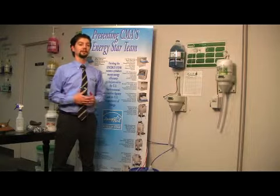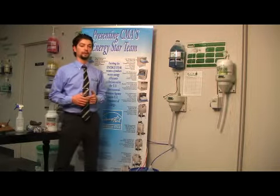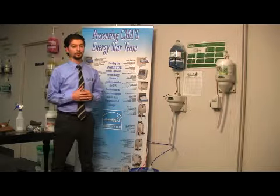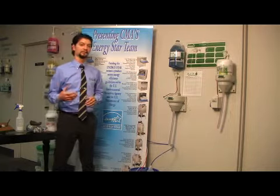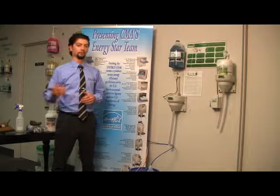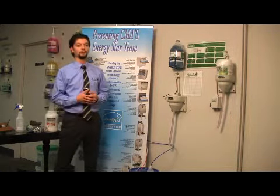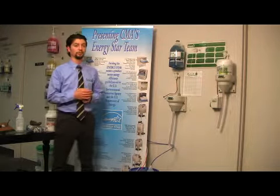Next, I'm going to discuss if you're getting too much detergent. This is going to apply to either the liquid or the powder detergent. The first thing you're going to want to check if you're getting too much detergent on your conveyor or your high temp door machine is if the machine has any leaks. If the machine is leaking, it's going to be introducing fresh water to replenish the water that leaked out, therefore diluting the detergent in your wash tank, and it's going to activate extra detergent to come in. So the first thing you're going to want to do is fix any leaks on the machine. That's going to save the detergent that you've already put in the machine.